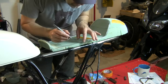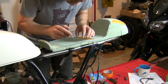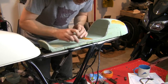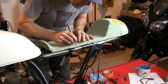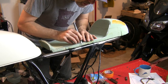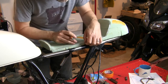And just as a bit of a finishing touch here — the glue, when I press the tubing down, it kind of smushes out the sides and I'm getting not a nice flat layer here. So I'm just using the exacto knife to just trim the glue a little bit so that once I come over the roundness of the vinyl tubing or the ridge that I've made, I'm going to be able to create a pretty flat line. Any imperfections here can be sanded out of the final fiberglass piece, and that can be smoothed — but just really big globs I'm going to tack with this knife and trim it.